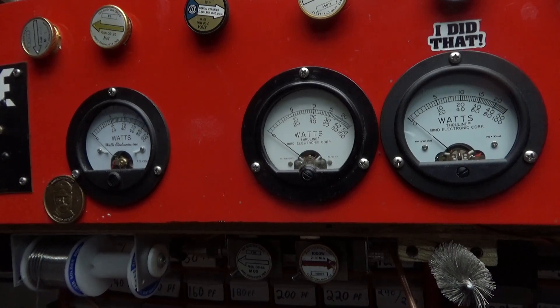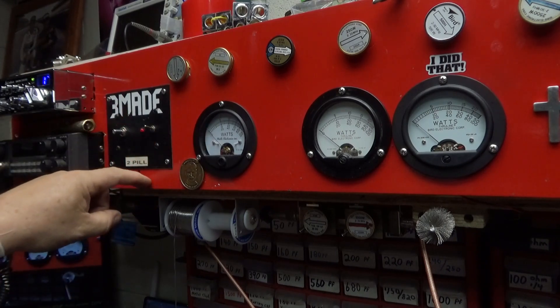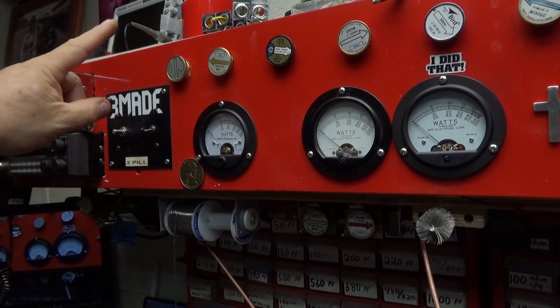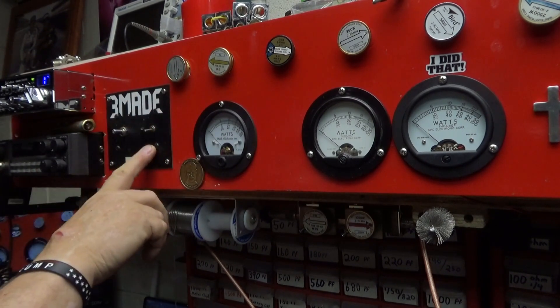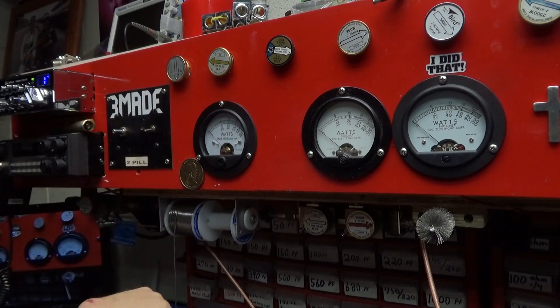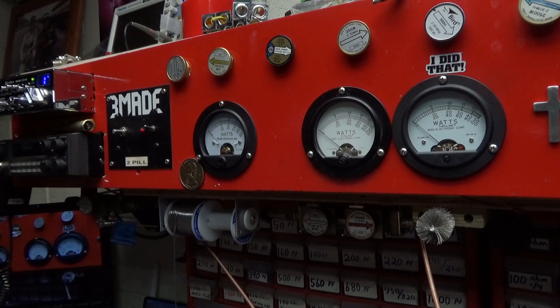Okay, we'll just have the radio hit it. This is actually a two-pill amplifier in here, but the way this is made it's got a variable on it and you can turn it down. The reason I've got this switch where down is off — so if anything up here falls down and hits that, it's not left on, so when I key up I don't burn an amp up. Like a slug fell down once and hit it — I've had that happen. So I put the switch so down is off — I have to go up. This variable, like I said, it's kind of like a Texas Star — you can variable the power, the output power in it. Some variables drive their own amplifiers — even though you've got it turned down it'll swing up, and you can't really dial it wide on it, but this one's made to where you can.